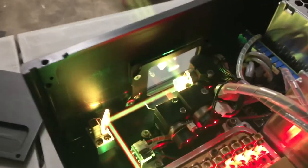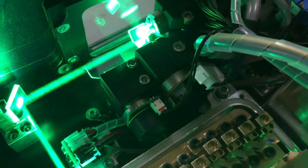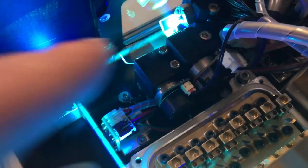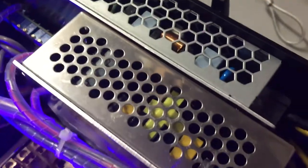Together, they're actually moving to draw the pattern that's being projected - in this case about 20,000 points per second. There's also a shutter in that beam path that can be activated. It's mostly a safety feature: even if you just need to shut the beam off really fast, you can put a physical block in it using that shutter. Everything else in here is really just some power supplies, since everything takes quite a lot of power, some boards for safety, and the amplifier. This amp is basically very similar to an audio amplifier, and it takes the signal from the computer and amplifies it so it can drive those motors.